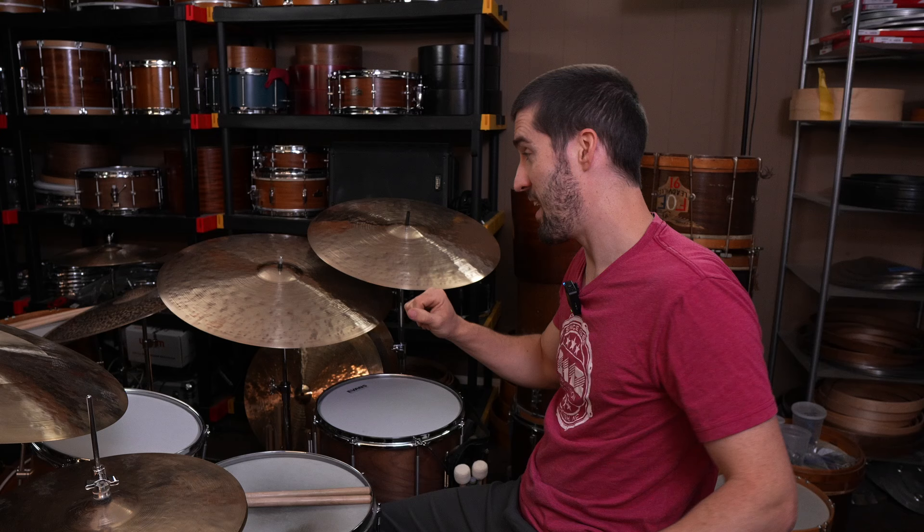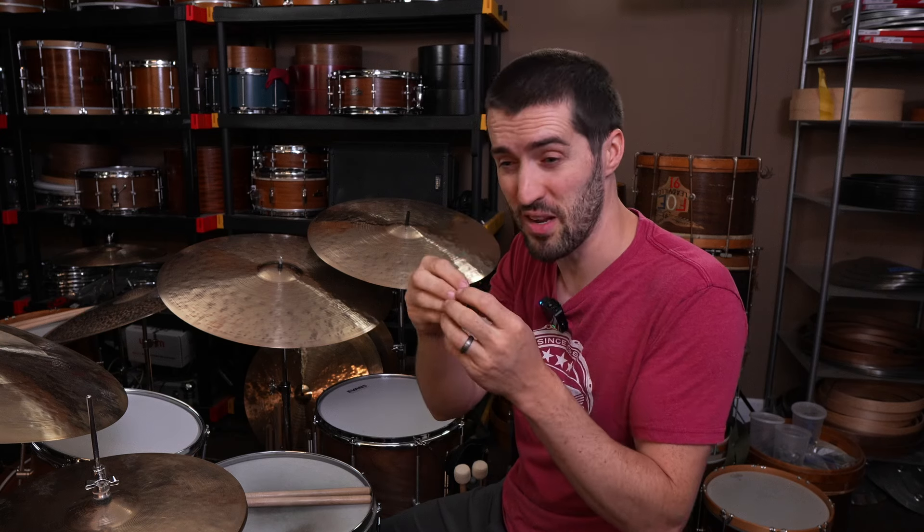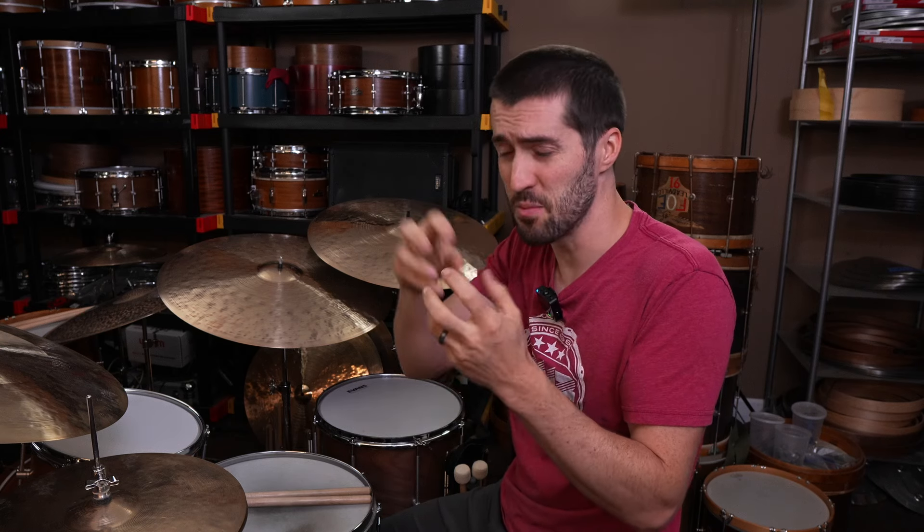I've done the extra work, and they're here. I think they sound freaking awesome. I'm really looking forward to hearing what you guys think. But first, I'll cut over and show a little bit of the lathing process of just taking off that crust. You'll notice that in these clips there's not a lot of streams of bronze flying off, because that crust is so hard that it just kind of flakes off and chips off — it comes off almost like a dust. It really eats through the carbide cutting tools I use to cut through material on the lathe. So you've got to really get through it before you can even start removing weight.